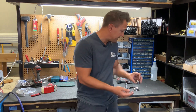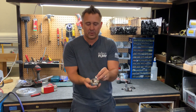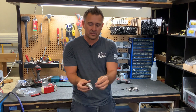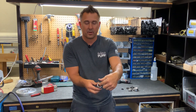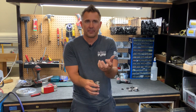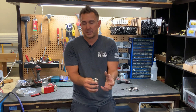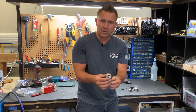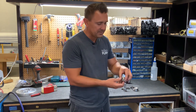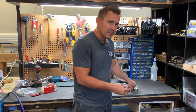This is going to happen with the 125, and it'll happen with the 200, which is just a bigger version of the 125. It could also happen with a spring-style check valve, because there are spring elements and a rubber seal inside. The vacuum is what opens it up to allow things through, and that vacuum may not be strong enough to break the bond from minerals or iron that's gunked up in there. So regardless of whether you're using an off-the-shelf check valve or the low-pressure-drop style we prefer, like the ball and seat, if you do not use the pump it could stick.